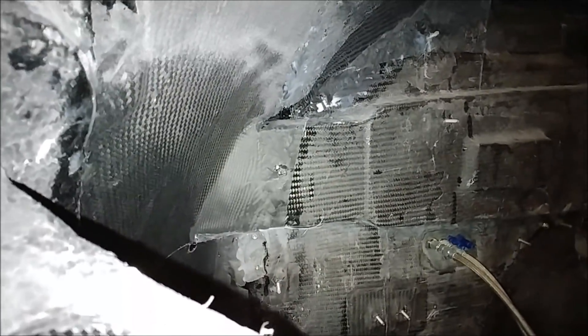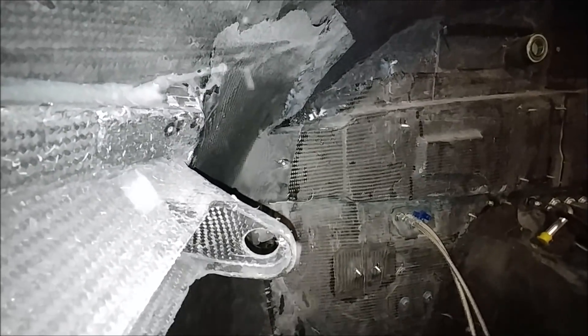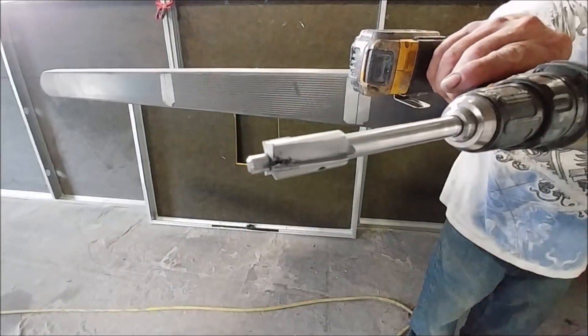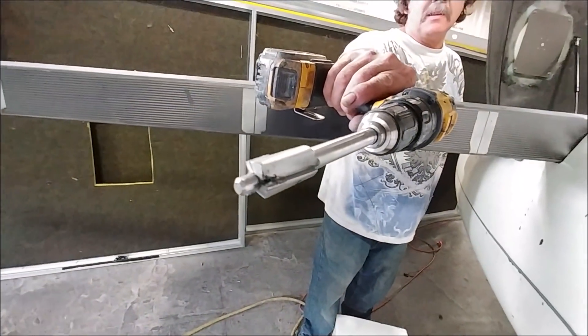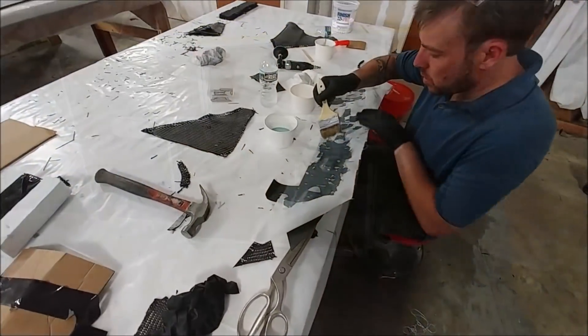As you can see here, he's just about through. There's the little pilot bit coming through — so it's five-sixteenths, and then I believe the larger size there is five-eighths or something like that. So that's a job done. And just to get a look, that's what that bit looks like — it has a little pilot at the front there and then a nice big cutting bit for the rest of it.